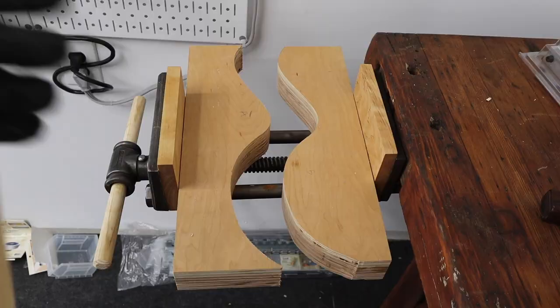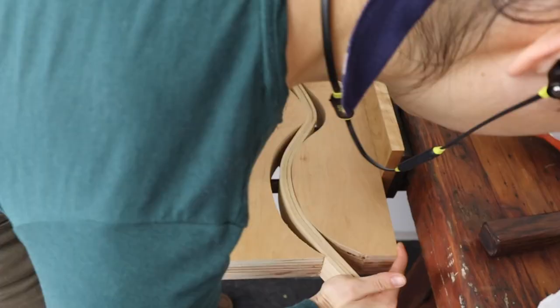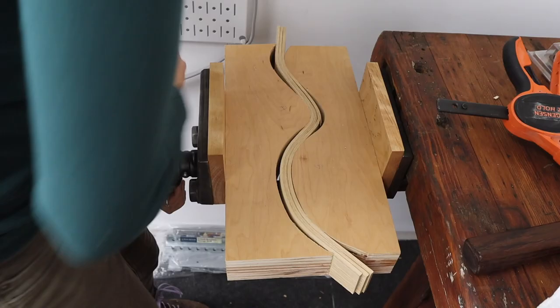And there you go, you just learned how to make a steam box in less than 5 minutes. And just by the way, it is easier to do this with green wood, but that's not super available in California, so I'm doing it with kiln dried, and it's fine. You just have to let it steam a little longer.